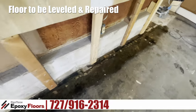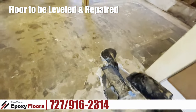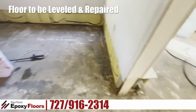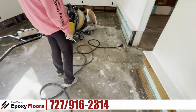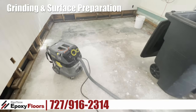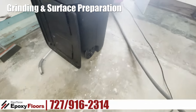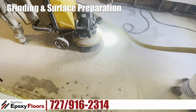It's probably carpet glue at one time, and along here we're going to have a lot of repairs — we're going to have to level this all up. Again, this transition was an attempt to level that out, but we're going to take that all out and start again. In this room we had a couple overlayments removed. I don't know why they were there because there was no reason for it — unless they were trying to match the transition. There's the floor, a little bit raised, so we're going to have to honor that ultimately.